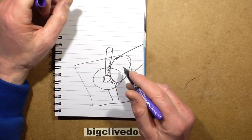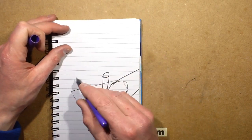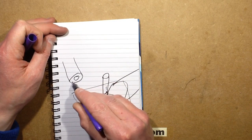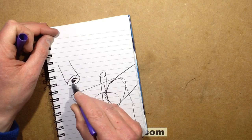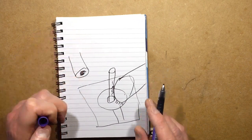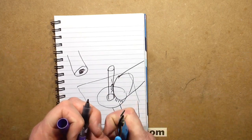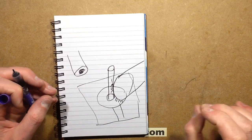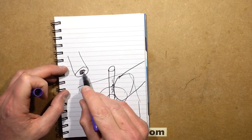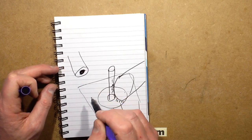And when that happens, the first thing that happens when you put the solder on is that the inside of the solder itself has a core. You use flux cored solder, and it's just a little round core in the middle. I know this because I took a bit of solder and I cut it off very cleanly, actually I used the Xuron snips because they do produce that really flat cut at the end. It's not pointy, it's very good. And it let me actually look with a microscope up the end of the solder, and there was a very obvious white core up the middle of the flux.